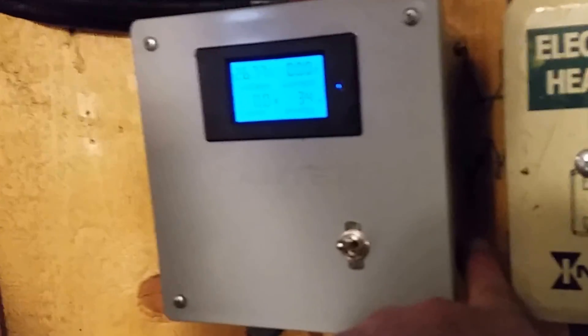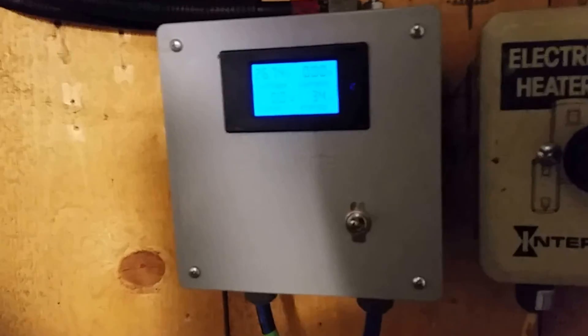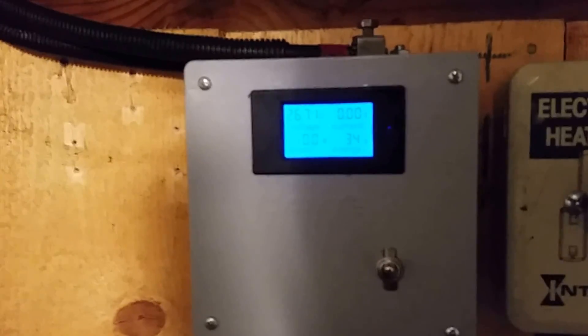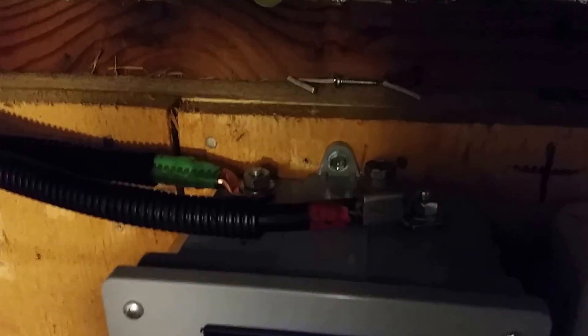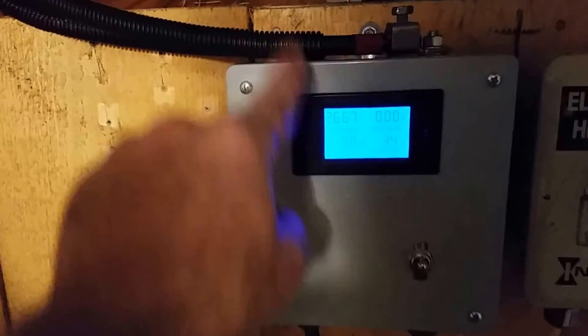On this side I have the shunt, and that's just on the negative side — I bolted it through so the shunt could be held on the inside, and it's just negative. On this side you see those two screws there — that's holding a fuse holder, and there's a 100 amp fuse there. The power coming off the positive side comes over through a 1 amp fuse going to this switch that controls this, so this is fused. I'll probably put some kind of covers over these so nobody can set a wrench up there. It's all bolted with lugs on the inside.